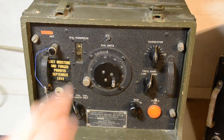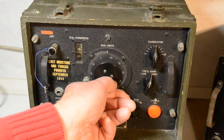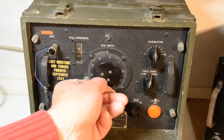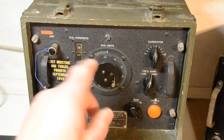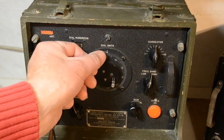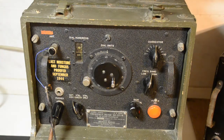Now we want the actual frequency we want, which is 5.4 MHz, and 5.4 MHz is dial value 1786.8. So we go back: that's 15, that's 17 — 15, 16, 17. And we want 86 on the units dial. We count up to 80, then we need 0.8 on the vernier, so that line is lining up giving us 0.8. So once again that's 17, 86, 0.8 — set and ready.